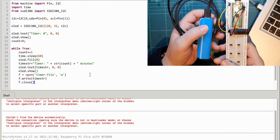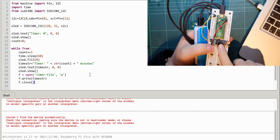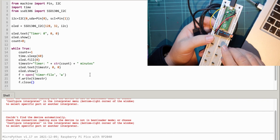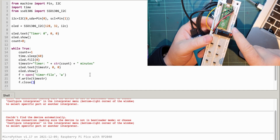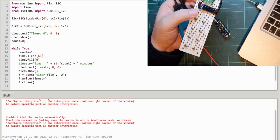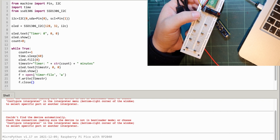So I wrote this little program. I've got it running on this original Pico. This program updates the screen every minute and it was an experiment to see how long I could charge a Pico on a power bank. So far this has been going for 850-something minutes - I started it last night. It brings in the driver for the OLED board, sets it up with a timer, and goes through a loop every 60 seconds. It clears the screen, sets up a string, and updates the screen with it.